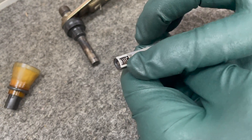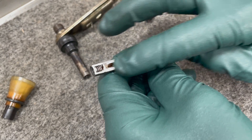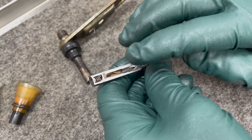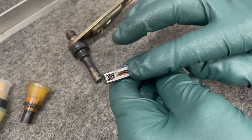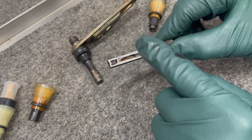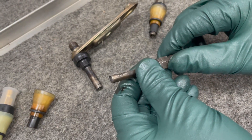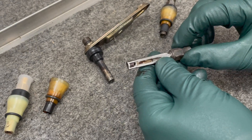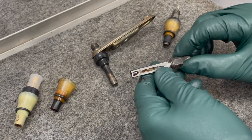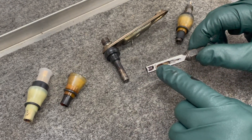The spray weakens. There's a little nozzle right there. These injectors don't open and close like most injectors. They're constant — CIS, constant continuous injection. So these are spraying all the time. They're not opening and closing. So when you see what I'm going to show you on the tester, you'll understand this is just a benchmark test. It's not a real test. You'd have to put them on a Bosch multi-thousand dollar tester to get a comparison of the exact spray patterns. But let me take you over there now.